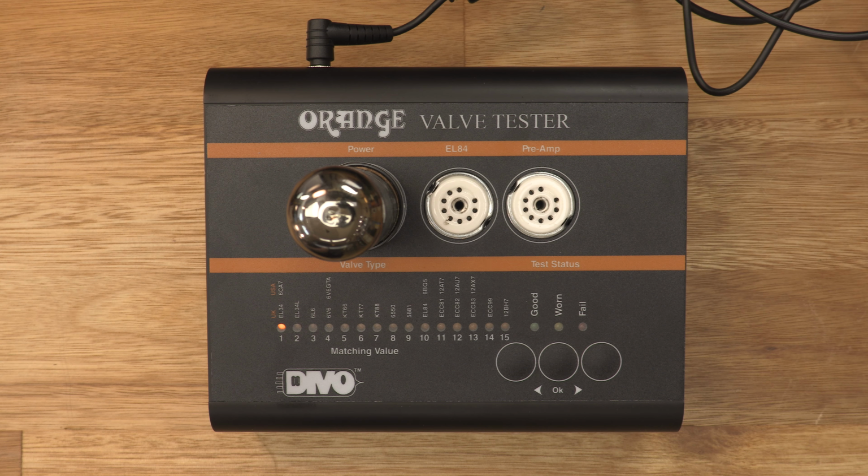So now I called up the manual, and as stupid as I am, of course, there's a video called Henning is a Dumbass. I mean, maybe that's true. As stupid as I am, I just put it on the table and plugged it in. So Glenn came down here and schooled me: dude, you have to pick the valve first and define the type. Then I called up the manual, and for some reason, Glenn is right. So yeah, you have to actually, with the left and right buttons, define what tube you put in there, which in this case we put an EL34 in there.